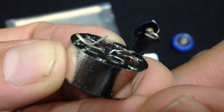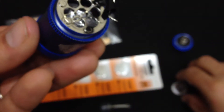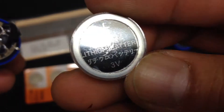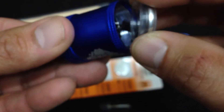It's really bootleg, but this light is quite bright, as I'm about to show you when I put it back together. Here's the battery housing — it originally had two batteries. You need this to hold the one so you don't have contact with the outer wall. Two batteries is too much — it puts out too much voltage. Because these are CR2032s — 3 volt each — and you'll get 6 volt with two batteries. That'll burn out your light.